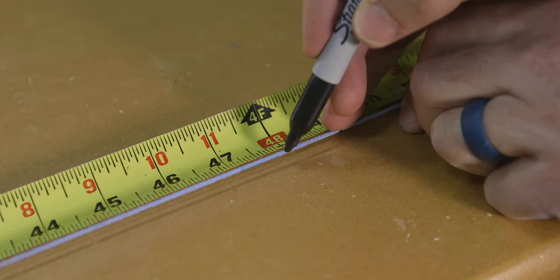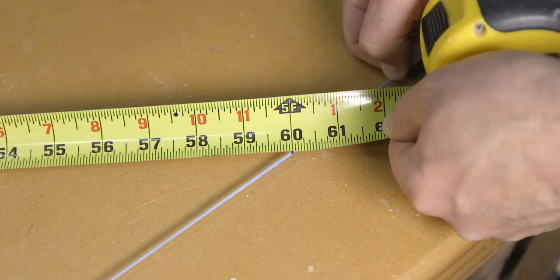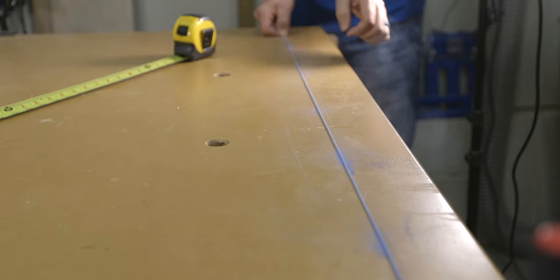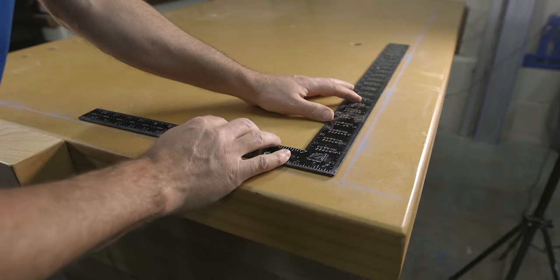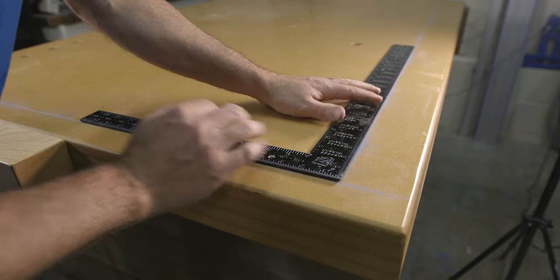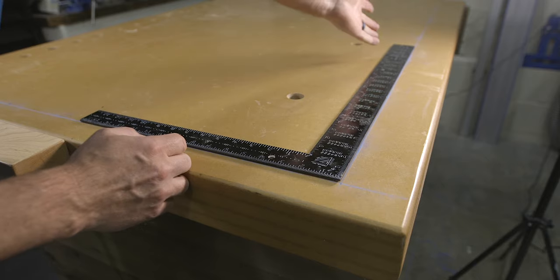Now all I have to do is swing the string either to the left or to the right until your diagonal measurement reads 5 feet, and then snap your line. With that, now you know that these two lines are 90 degrees to each other, and you can use that new line to help with whatever layout you need for your next project.